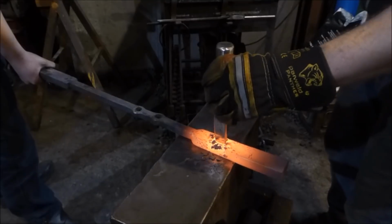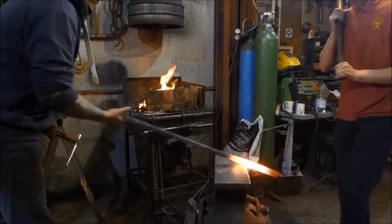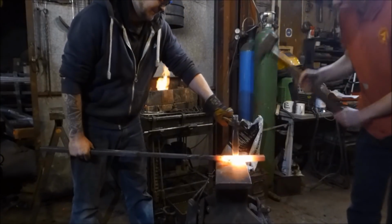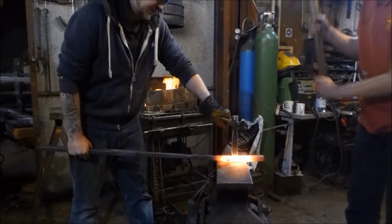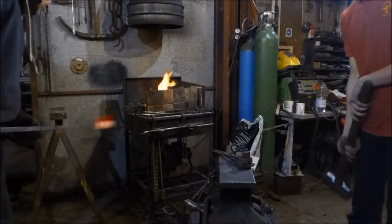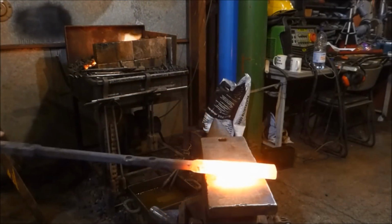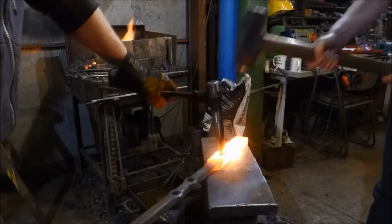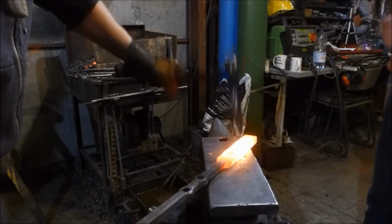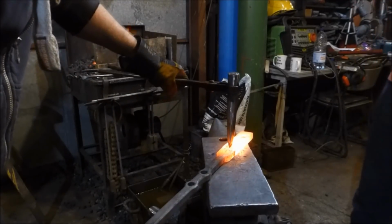Now, when I did some of my first jobs, I was caught out because I didn't take into consideration things that can go wrong whilst on site. One of the things that happened to me was I was fitting a set of gates across a lady's driveway, checked one side of the driveway to see what was under the ground, found a little bit of concrete and thought, well, I'm going to get away with this. Then on digging the opposite side, I found that the builders who'd built the house had either chucked the remainder of the concrete that they had, or they had a problem and had to level something out for some reason, and therefore there was a considerable amount of concrete, which meant that I had to hire a Hilti jackhammer to break all this concrete out before I could put my post in. There was also a time cost, the time of getting the jackhammer and the time to do the drilling and so on.